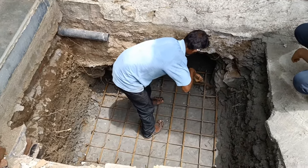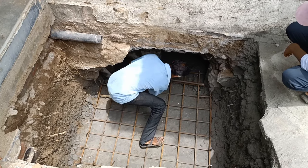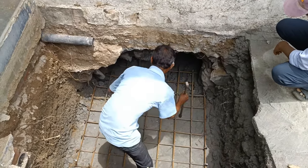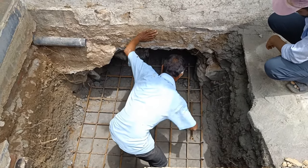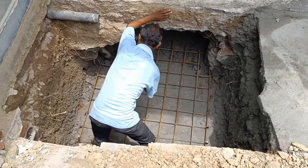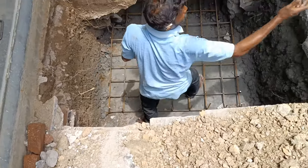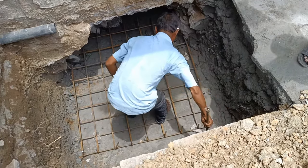So this lever is meant for making the rods rise up into L-shape. You can see him making the L-shape. That is very important friends — whichever rod is touching the earth will affect the structure in future, because the concrete won't pack properly there, the earth will rust, and eventually the entire structure in that area will be washed out. Better to avoid that sharp edge contacting the earth material.